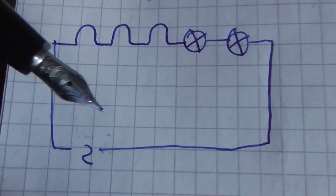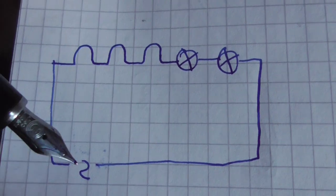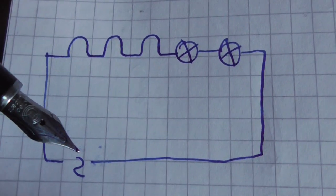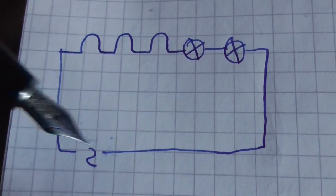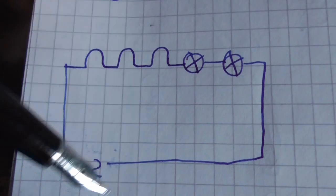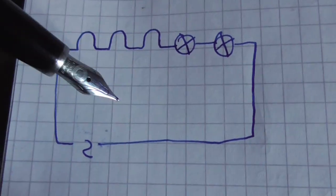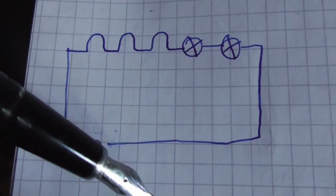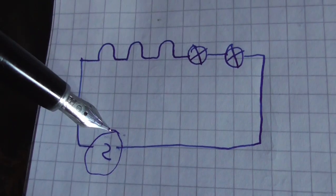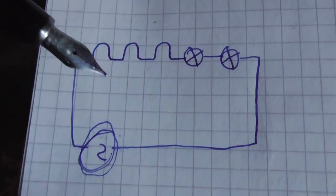Also, have you noticed what it means to have all your filaments dependent on direct line voltage? Well, it means that every voltage you derive of this circuit is going to have something to do with line voltage. Therefore, shorting one side of the FM circuit to ground will risk a half wave short depending on which way around you plug this thing in.